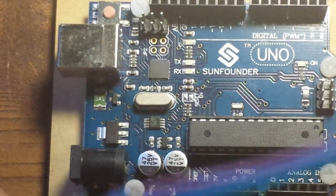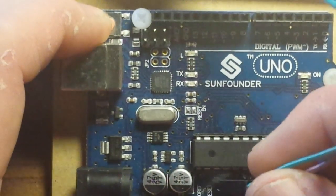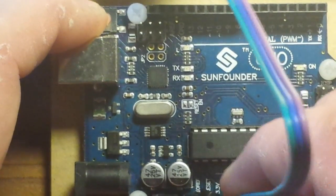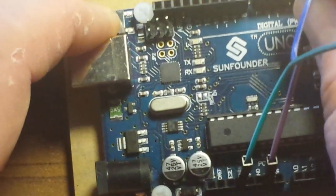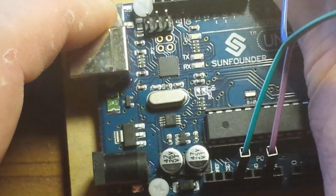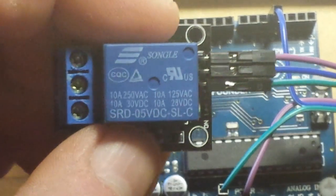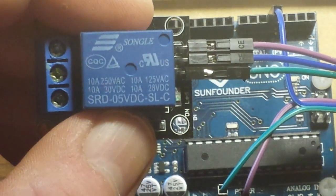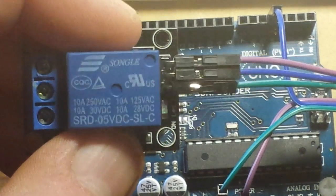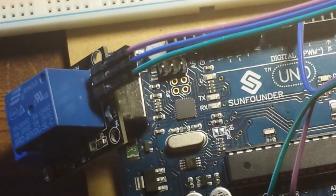Hooking up the components to your Arduino is simple. You use these jumper connections, plug in a ground and a 3-volt or 5-volt line, then put your signal wire into one of the ports. You simply program the Arduino to send a signal to that port, and that will control whatever you have attached, such as this relay. We'll get into that more in the next video when we talk about the programming environment for the Arduino — and don't be scared, it's really simple.